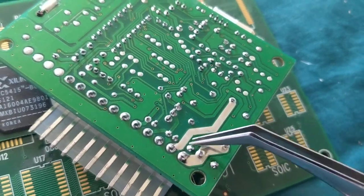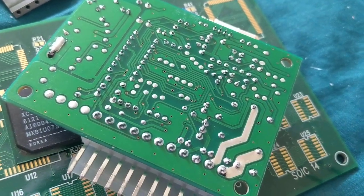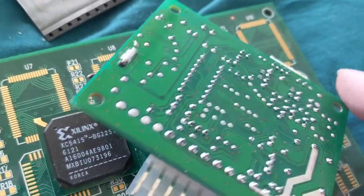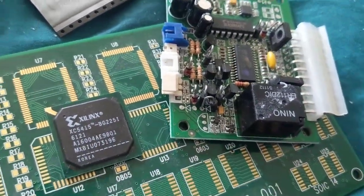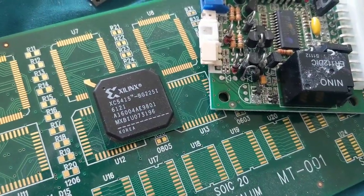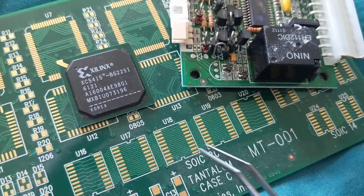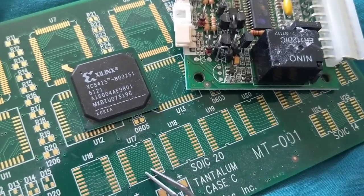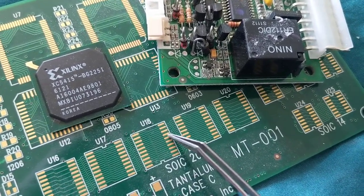So therefore, if you reflow, you resolder something, is the connector, you have to know how to do it properly. Okay? Use flux. I'll show you in a video. Hopefully, there'll be an interest for that. I'll show you how to do it properly. Again, all chips, all modules in all cars will have these types of surface mount chips. Whether it's 200 pins, whether it's 15 pins, whether it's 6 pins, it does not make a difference. They have to make contact with these pads.